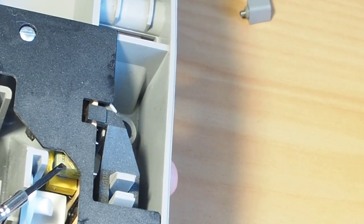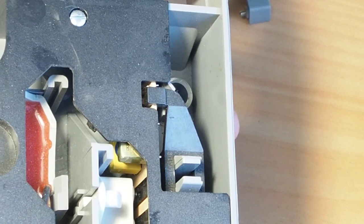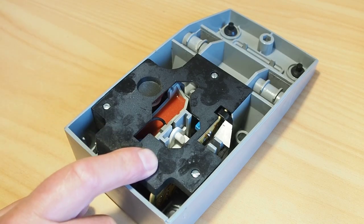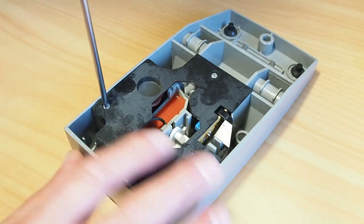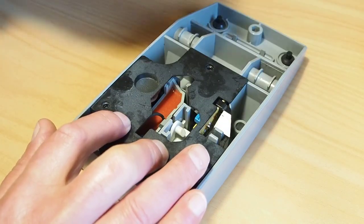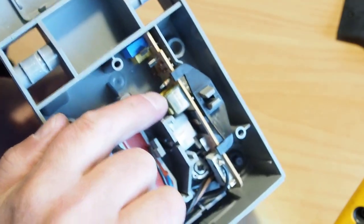That capacitor there is looking a little bit dodgy, and I'm wondering if that potentially is all that's causing the problem here. So swapping that capacitor out is actually quite a good thing to do to sort any potential issues out. And you can tell just by visually inspecting that there is a problem there. Next thing to do is to remove this black cover here. Just three flathead screws. Actually have more than one capacitor here, but these are notoriously bad at failing.